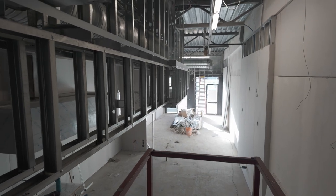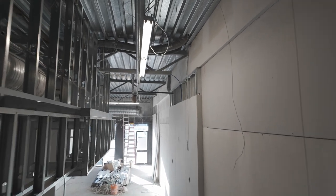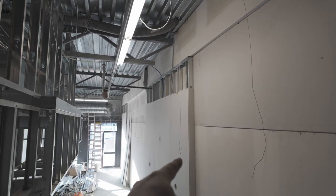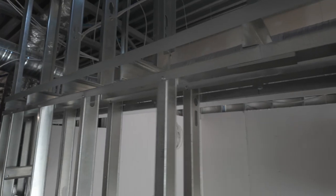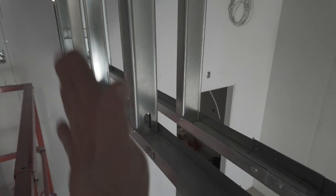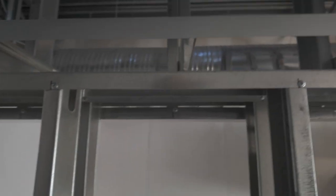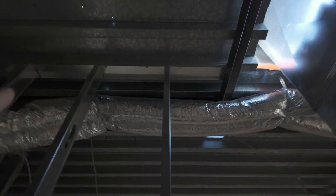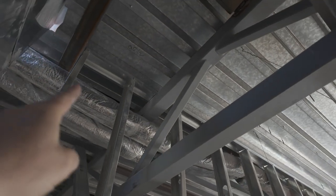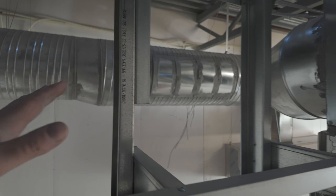Establish and benchmark your elevations somewhere you can set your line laser. I decided to set it on this furring wall because I was able to set it on this side for half the wall and then on the other side to capture the return. You also need to set up another line laser to shoot the plane - what I call the plane - which is the face of whatever bulkhead you're working on. The first one is the back 3-5/8" wall - you're shooting it all the way up to structure and installing your top track and drawing your 16s.